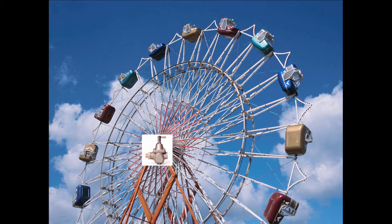So when we talk about pump head, we're not talking about the height, because like a Ferris wheel, the weight of the car going up over here is balanced by the weight of the car coming down over here. In a hot water heating system, we use a fill valve to fill the system completely to the top and put it under a few pounds of pressure.